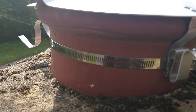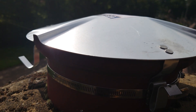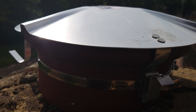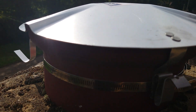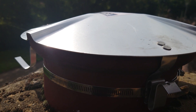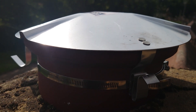One strap cap fitted, and now the customer's not going to get any water coming down the chimney causing their damp patch. What they'll need to do is get some damp seal from B&Q, Jewsons, or any DIY store — it's about ten quid a tin. You must put that on, otherwise you could put 200 coats of normal paint on and the stain will just keep coming through. Put the damp seal paint on, then do your decorating afterwards and you'll be fine. Give it a bit of time to dry out. That's it — all done. Have a lovely day from Zachary Sweeps.